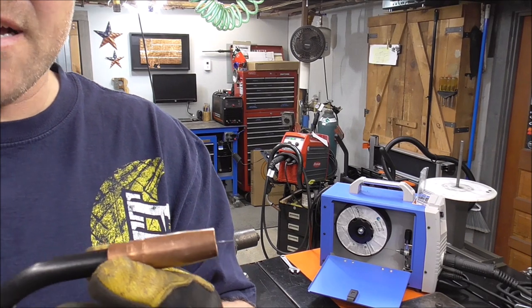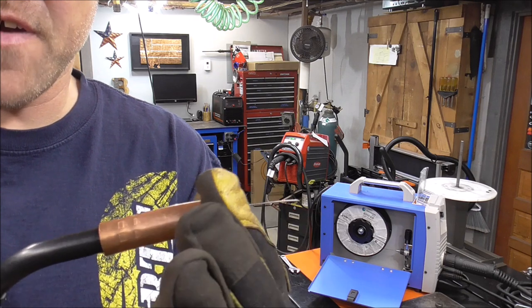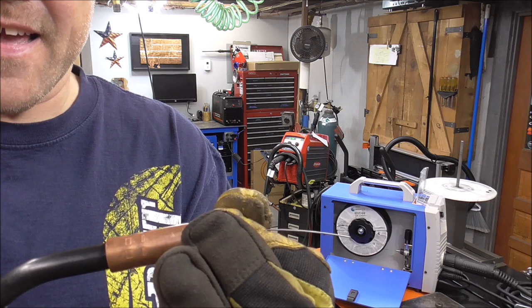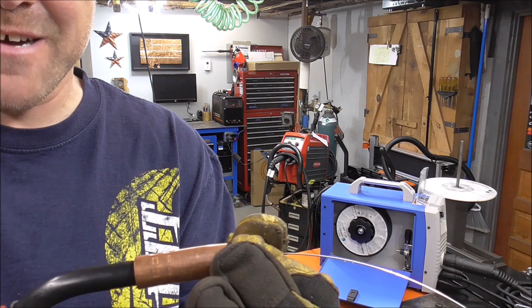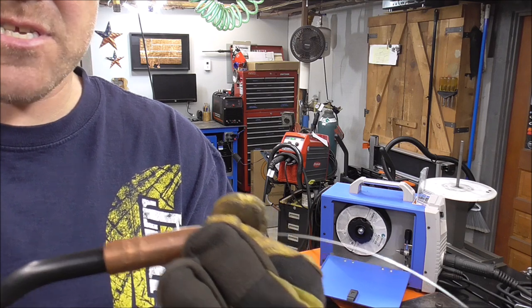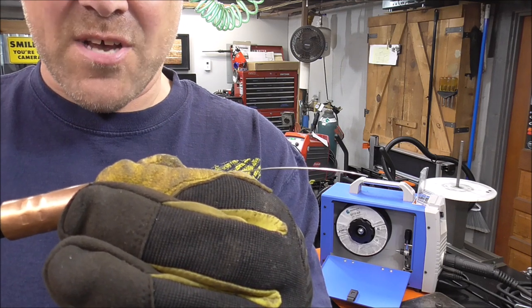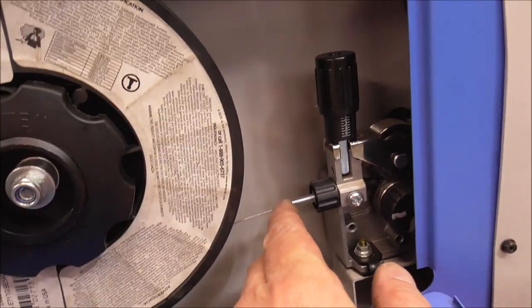Here's a great way to test if you've got this just right. Pull out a little more wire, grab it with a gloved finger as hard as you can — and I can just barely stop it. Look at the reel in the background. It's taking a lot of pressure, but it's still feeding through. I can stop it if I need to, but it's hard. So now this is properly adjusted. I'd write down that number so I know the setting for this wire.